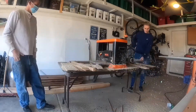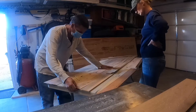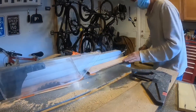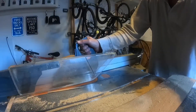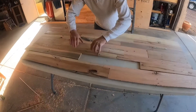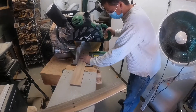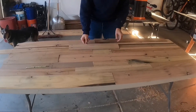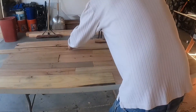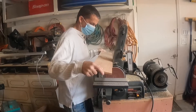This took quite a bit of time with the planer but we had no issues with performance. Once we had them all planed down to pretty close to the same height, we set them back on the table and began trimming them to fit. I ran some through the table saw to get them to the same width depending on what row they were going to be in. Then I trimmed the edges on the miter saw — just took a little bit off to make sure it was square. I would lay them back on the table and mark the final cut. This process took quite a bit of time, but it was fun figuring out what looked good where, making sure we never had two seams in the same location in adjacent rows.